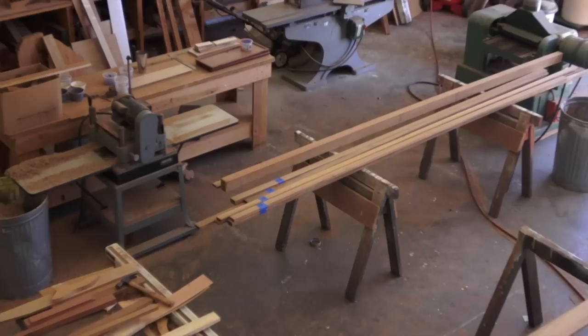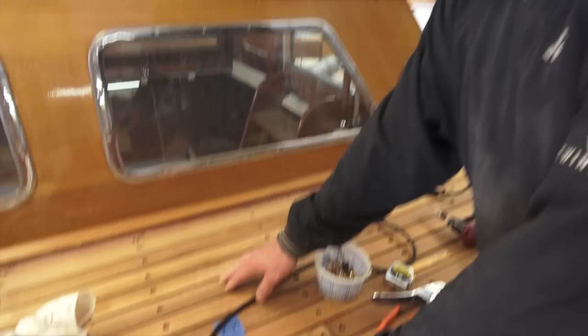Beautiful. See, the reason we were going port to starboard before was mainly because of available materials. In other words, lengths is what we were worried about. So we have 14, a 12, and so forth. We wanted to match it on the other side, so you only have to lay it out once. So we'd be going back and forth, port to starboard. Then once we got to number 6, well 7 is the first one that runs past the cabin side. So once that was in, we didn't care.